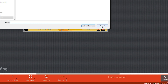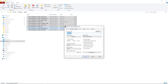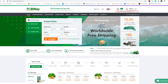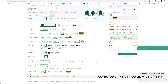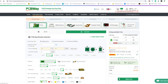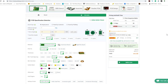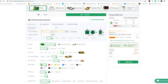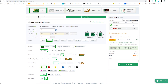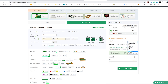Then you must compress these files into a zip or rar file. To order our PCBs we go to pcbway.com, which is the sponsor of this video. We have to input some data about our PCB like the size, thickness and some other options. The other options are selected by default but feel free to change them according to your needs. If you order 10 PCBs within a size of 100x100mm, the production cost will be $5 plus shipping.